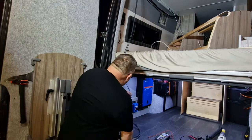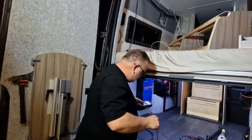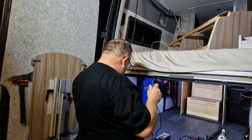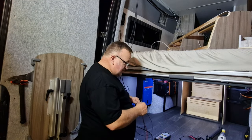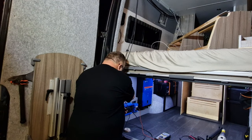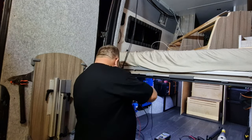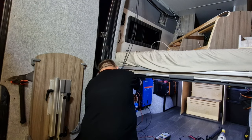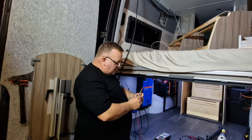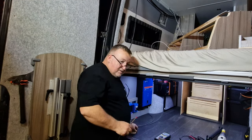While we've still got both ends of the cable inside the cab, this is a good opportunity to bell everything out. With your multimeter, select continuity to get a tone — you can hear that. Get the two ends of your cables — I've already marked these — and bell them out. That's our pair. But a good rule of thumb is to prove the other cable as well. If they were damaged and rubbed through, or somebody put a screw through them, you'd get a tone. That's good — I'm happy with that.